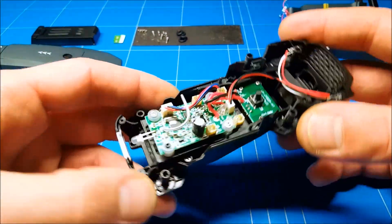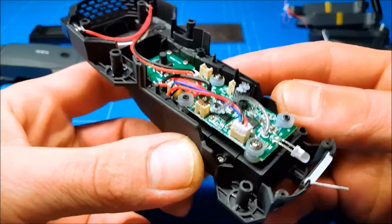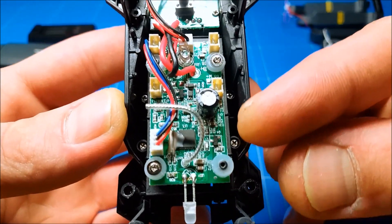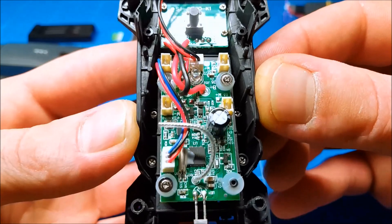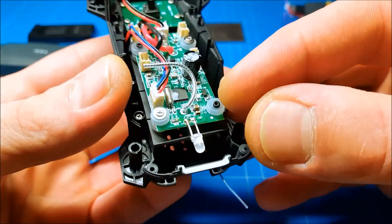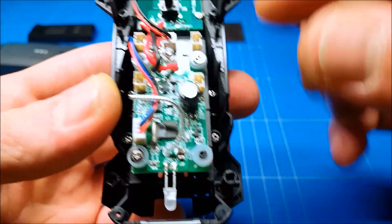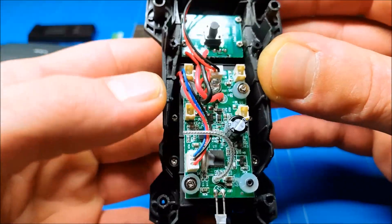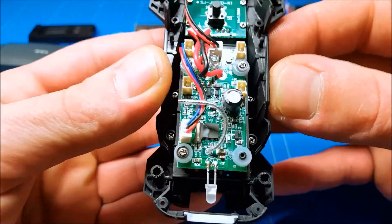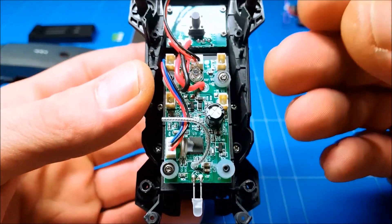Welcome back — we've just removed all four arms so we have a better view of the flight board. We're going over the good things and bad things we've found. All the connectors and soldering look pretty good — they've done a nice job. They also added soft mounts to the flight board, which is a really nice upgrade — didn't expect that. The downside is I'm missing a screw on one side and another in the corner, so they only used two screws. I'd prefer all four for a proper job, and that's why we do this in-depth inspection.